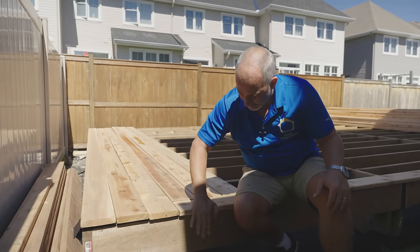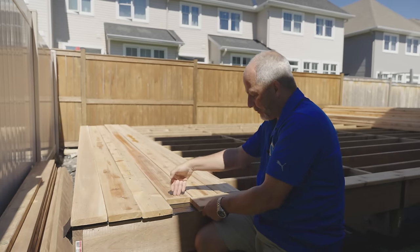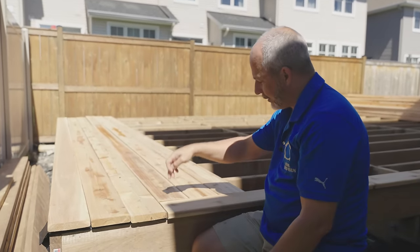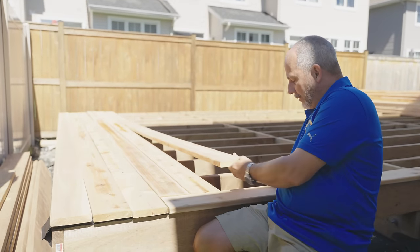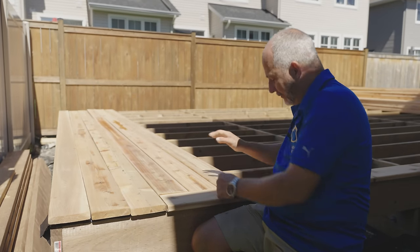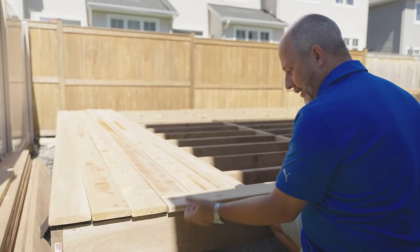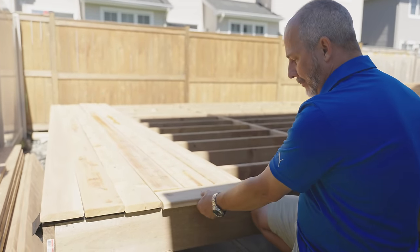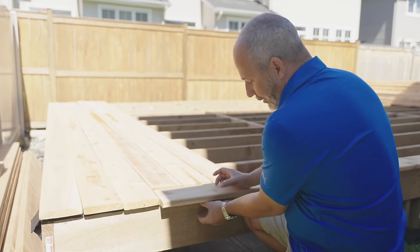What I like to do is this way, add the nosing, which is why we built out this box, added the tape, add the nosing, and then before we install all the boards, we're gonna take our palm sander. We're actually gonna round all these edges and clean this up as well. That makes all of this super sexy. And then I can set my nosing for the depth that I need. Now in this case, for the purpose of the demonstration, I put it in a little deeper, but I am gonna bring it out a little bit further, and I'm gonna rip one of these boards in half and stick it underneath.